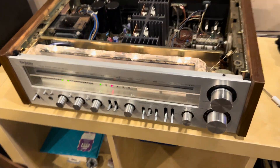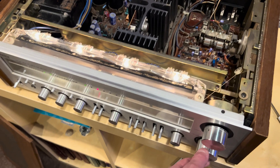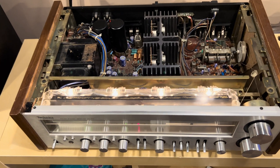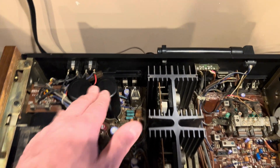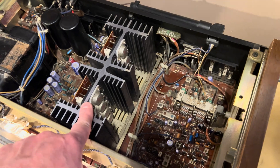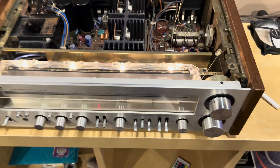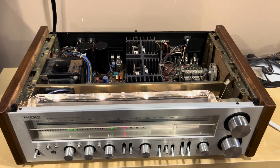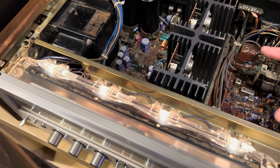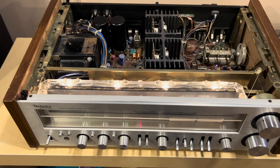When you're trying to diagnose a system and see where you have a problem — if you're not getting really great fidelity, it could be your tone board. If you're not getting great power but it sounds okay, you may have a starved power supply. If you're blowing a fuse, it means something is short-circuited or maybe one of your output transistors is bad — when these go bad, they short and typically blow a fuse. So when you're doing any type of troubleshooting, you go through a process of elimination: do I even need to touch the tone board, the tuner, or the power supply? Depending on what's not working, you can focus in on one particular part.